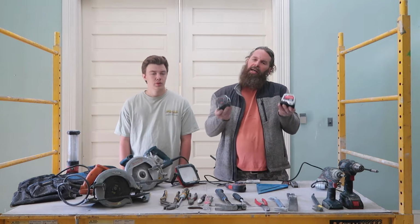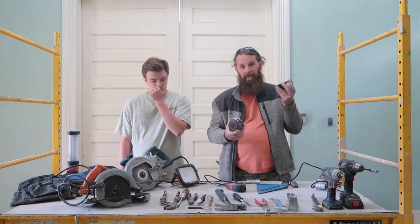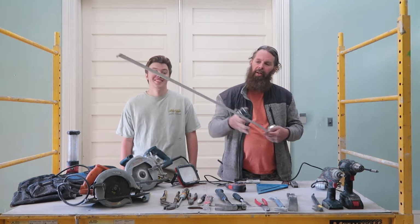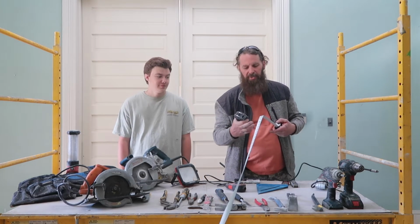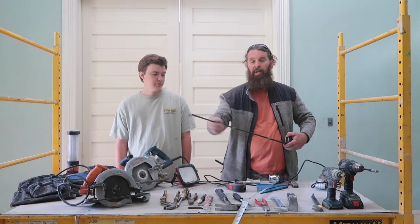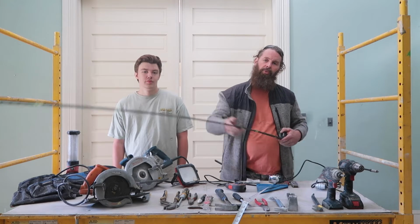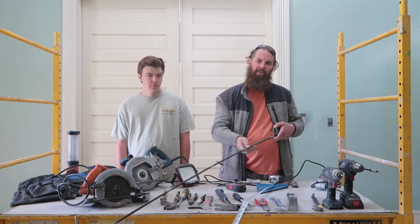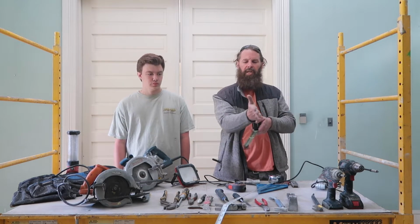Even though the brand name for Craftsman might be a little bit better, one of the things that we happened to notice was the flexibility of the tape, your break fall. By the time your tape gets out so far, here your break falls at like 6 foot, where when we're using this tape, we can nearly go 14 foot. So it's a lot better if you're trying to stretch a room, or if you're trying to measure something tall. It's a much stiffer, more rigid tape, and it has a much bigger cup on it here.